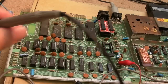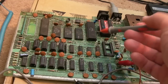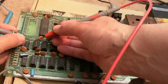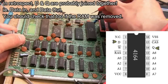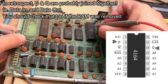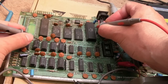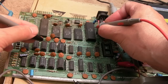So I haven't scoped anything here, but just in relation to the RAM connectivity. Because obviously this was off the board, that was off the board, could be a broken trace somewhere, and could be one of the ones I missed under here. So, just testing connectivity again, pin 2, this is the data in, data out pin on each of these DRAM chips here. Pin 1 I think is just unused, as I say. If we measure down here on connectivity, got a join, yeah? This is the chip that the dead test is saying doesn't work. Again, we just swipe down there, we've got a join. So we know its data connection is getting there. We know all the other address line connections, every other connection on there, are in parallel.